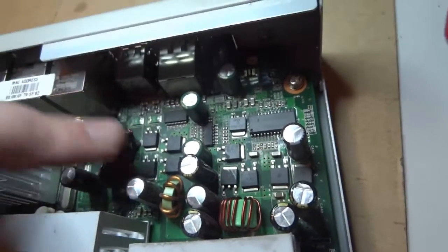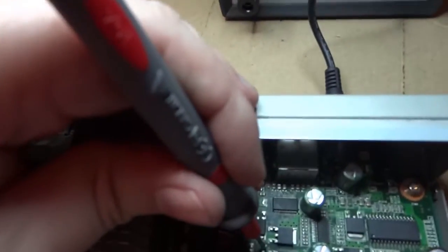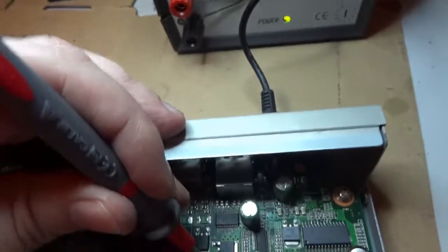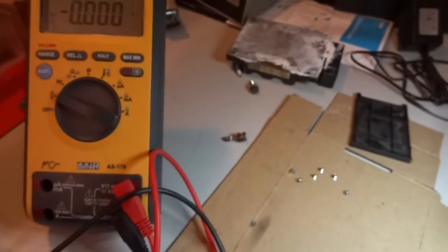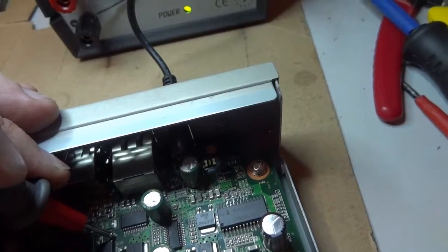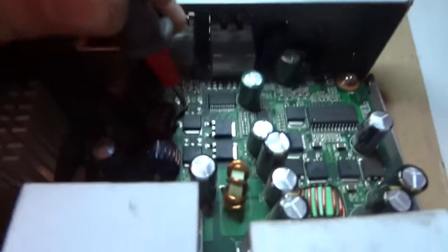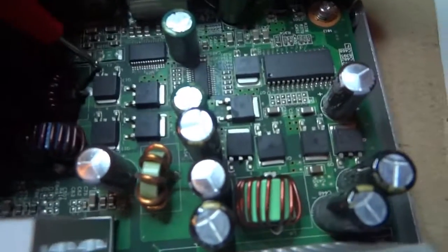In practice, there is no voltage — not at the input and not at the output. Input and output don't have any voltage. Here we have the entrance of the other regulator at 3.5V and at the output we have 0 volts. So it means that we have some problem in this area.